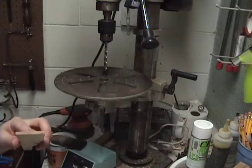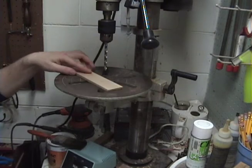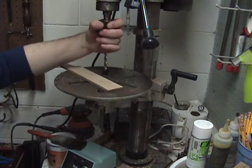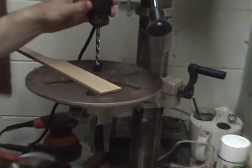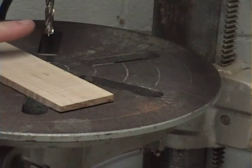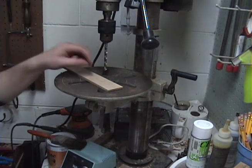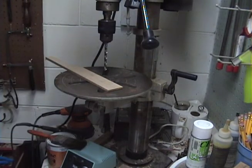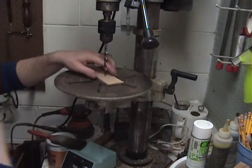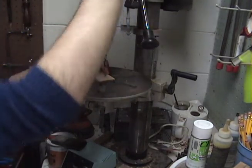One of the real keys to getting some really nice-looking dots is to have really clean holes, so your edges are of utmost importance. That's why we're going to be using some really nice drill bits. If you look closely at the bit that's in here, it actually has a pilot point and a section that scores the edges, so it creates a really clean hole. That's what's going to make your dots nice, because if you have any chip-out, the dust we put in there fills up those chips as well, so you won't have a perfect circle. The keys are good drill bits, correct speed on your press, and moving slowly with the actual drilling process.